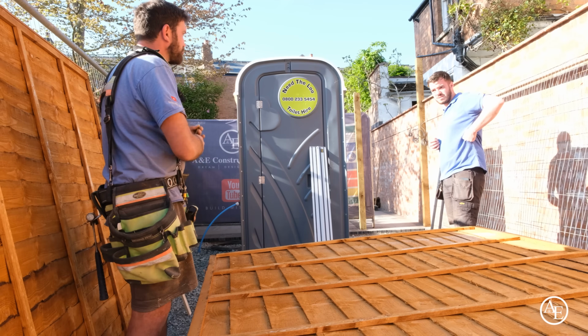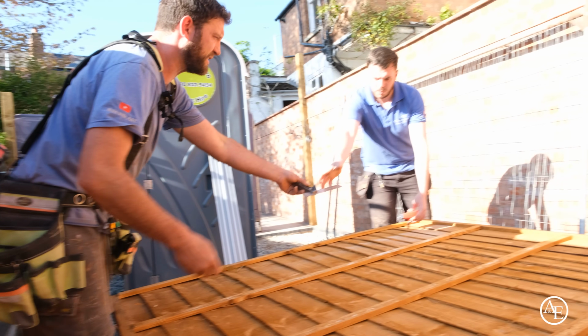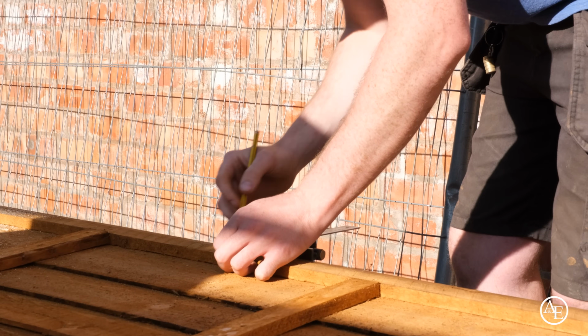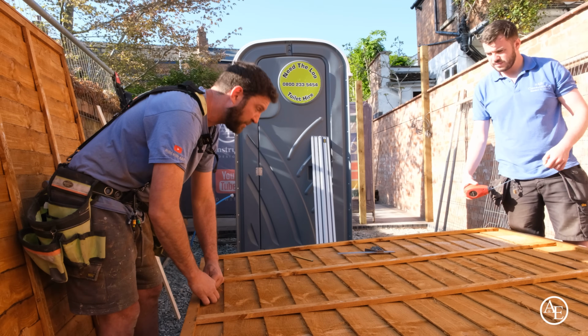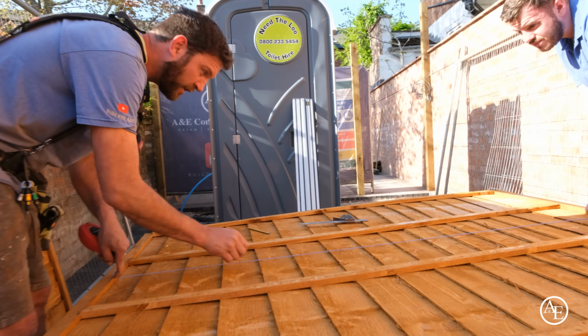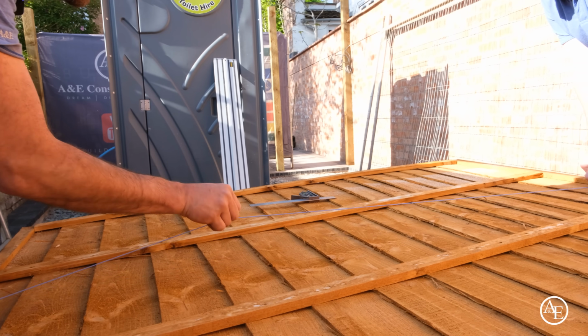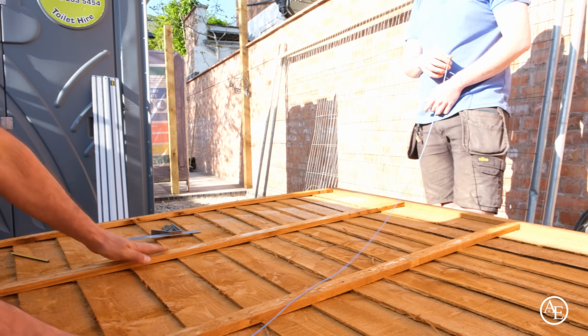So top was 6, 7, 8, so measure from top. 6, 7, 8, right, so that's there. 632 bottom. 632 bottom, so nearly a 40 mil discrepancy. We'll put a string line on it, get this line squared across. You do the same that side, look. And what we're going to do, James, is hold it below this timber line, or else it's not going to snap onto it. So, okay, say when? Yep, when. Okay, so we've got a bit of a line to work to there, so that's good.